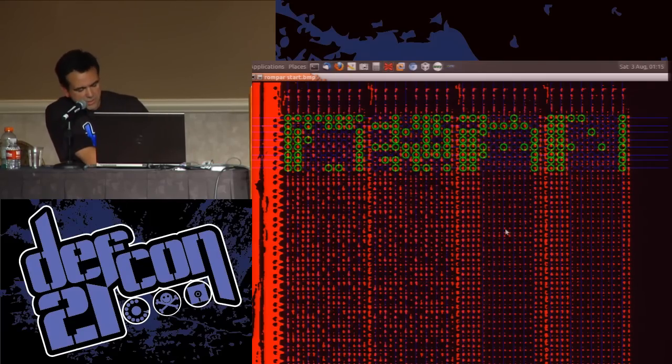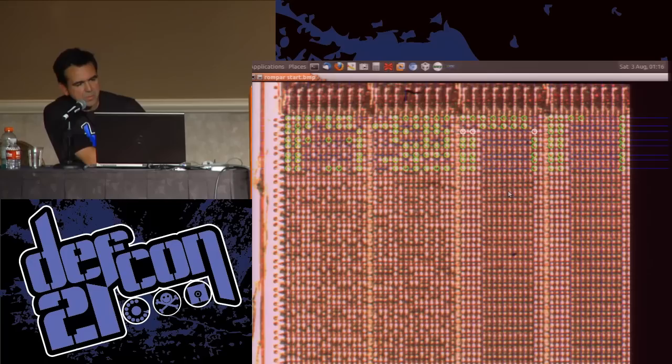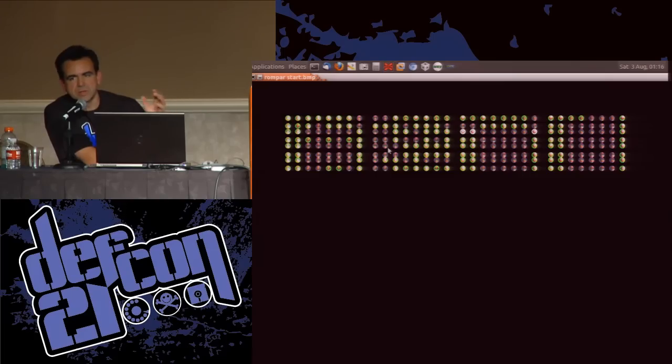And now you can actually see, okay, so those apertures, basically the automatic aperture size is based on the size of the gaps between the lines, so I can actually reduce those a bit if it's over-reading. We'll adjust this guy. Adjust this. Oh, you can flip bits as well, obviously. And actually here you can see how useful peephole mode is, because when you're trying to manually check if you've got a 0 or a 1 in the right place and you've got all these other dots interleaved with these guys, sometimes it can be quite confusing. So if I go into peephole mode, all the extraneous imaging that my brain doesn't need to deal with has been removed, and I can just look at only the dots I'm interested in. Yeah, so that really helps.